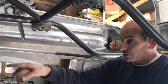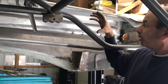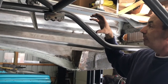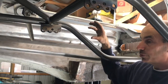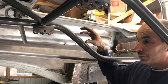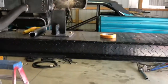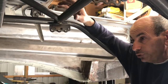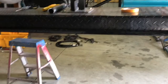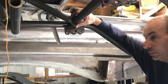Now the cable, because it's got to make this big loop, the cable's going to be way up here, and the pump would sit higher, almost as high as the tank. The tank has to gravity feed it, right? So it's got to get gravity fed. And we can't lengthen that cable. We're going to just change it over and put the fuel pump. We're going to make a tank in the front of it because it'd be a lot cheaper than getting another one of those 2 feet longer. Right.